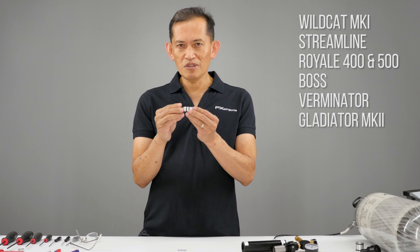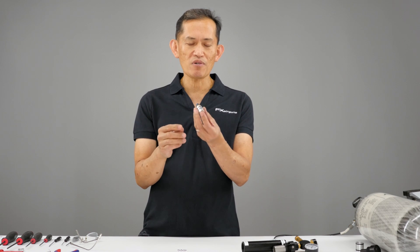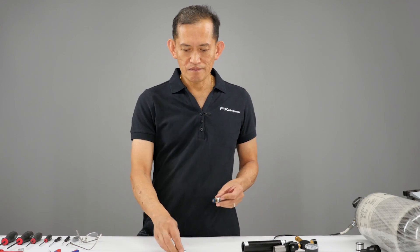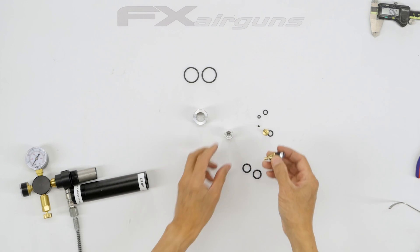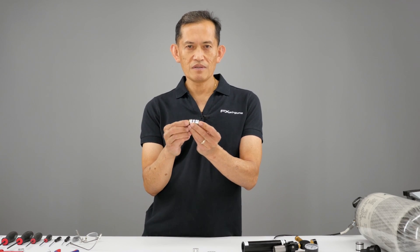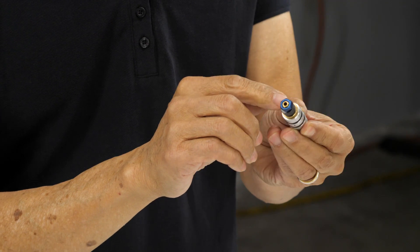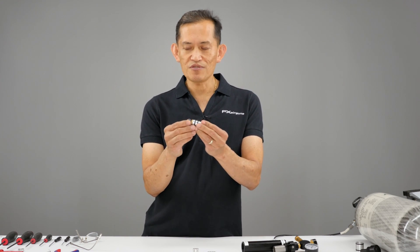You have to be really careful — you want the gun to perform really well, so you need to be thorough in cleaning it, inspecting it, and reinstalling the o-ring and getting proper measurements. This section here is lock-tited on. The threads are lock-tited on to the body.